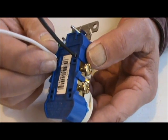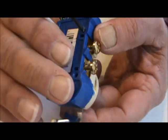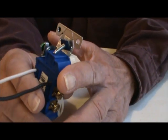What you want to do is go to the first receptacle that's not working and take that receptacle out. If you know which circuit it is, turn the breaker off; if not, test it with a meter when you get the receptacle out and make sure you're on the right breaker. Go to the first one that's not working and the last one that's not working, because you don't know which way the wire is fed in. Chances are they've come loose.